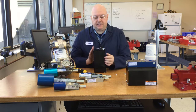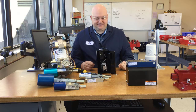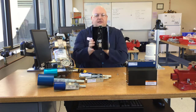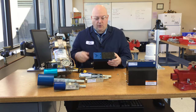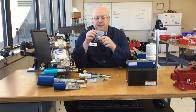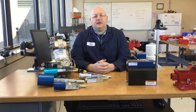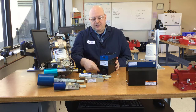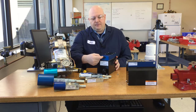Once you have two of them removed - I already loosened these two - you can push in and it'll pop open. From here you can see that the four screws to mount it are the same. Because you don't use air or hydraulic fluid to drive this, it doesn't have the second and third hole for the small o-rings. We still use the same parts kit with the same four bolts, the big o-ring, and three small o-rings. There is still the bleed screw here, but there's a cut where the grease will seep out above the bleed screw.